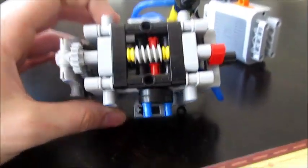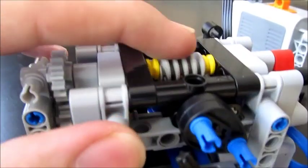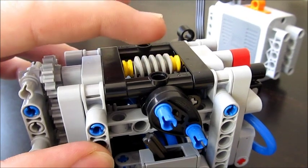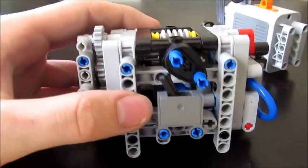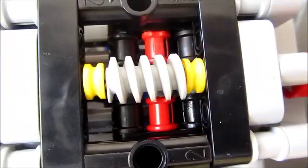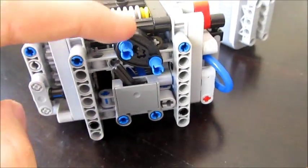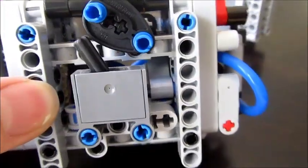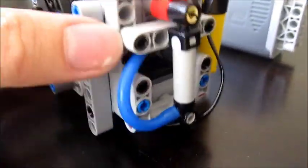It's actually really cool how this mechanism works. On a normal auto valve, the worm gear would actually slide back and forth on an axle. The driving ring is mounted securely and is stationary — it doesn't move. What moves is actually the eight-tooth gear below it. On this slider mechanism there are actually two axles inside, and it slides back and forth along with this cam, which is this oval oblong piece. That is what switches gears, or in this case the valve.